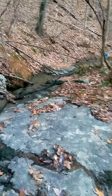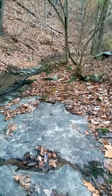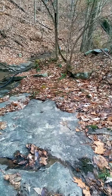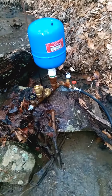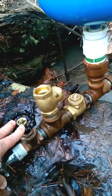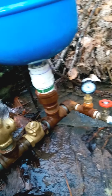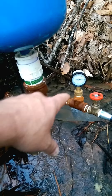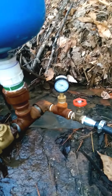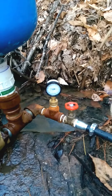You get a flex pipe, one and a quarter inch, 100 feet going downhill. You have to have at least about a three foot drop to make this thing work. Here's the pump — pretty basic. The one and a quarter inch pipe comes in here. There's an on and off valve — pretty optional. Check valve. Pressure indicator, which seems to be putting out about 20 pounds of pressure.